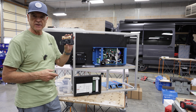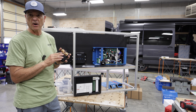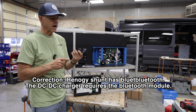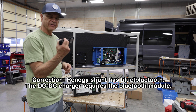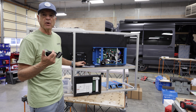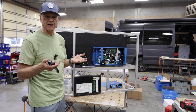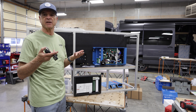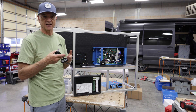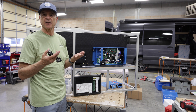For monitoring we're going to use this Renogy shunt. We often use the Victron smart shunt which has Bluetooth built in so you can monitor it from your phone. With the Renogy system you have to add a Bluetooth module — not really expensive, around $50. They also have what they call the Renogy One, which is a screen that gives you information on your system. It doesn't have nearly the capacity of the Cerbo GX, but I'd compare it more to the Victron smart BMV 712 — the screen is actually a little bit nicer and bigger, so it's a pretty good monitoring system.